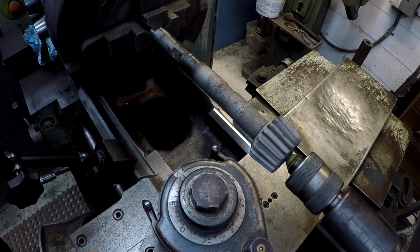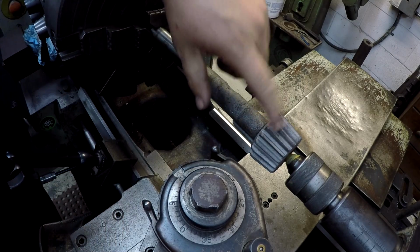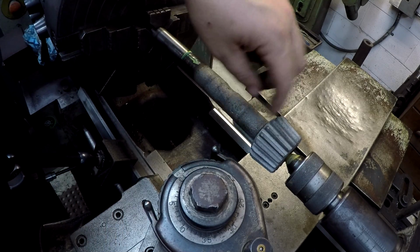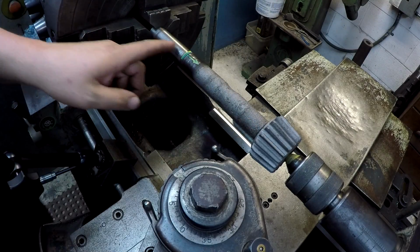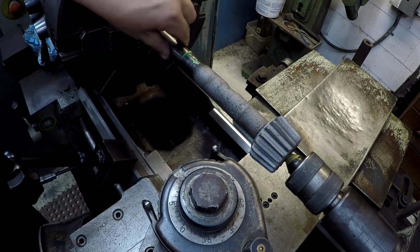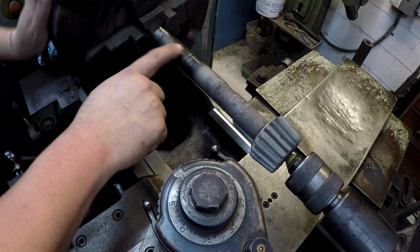So next thing up, I need to find my masking compound, and we're going to coat the gear down really good, paint it on there, and this undercut, shoulder, and then from this point forward, we'll coat it down there too. Probably about 1 inch wide area.